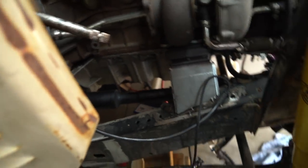That's the driveline at full bump - there's probably 15 to 20mm between the drive shaft and the trans. The clip corrupted on my camera so here's a photo of the engine and front axle clearance. There's probably around 5mm static clearance, and the engine can vibrate a little, so I'm thinking I'll raise the bump stops to compensate. I'll do that when I'm doing my suspension and axles in a later episode.